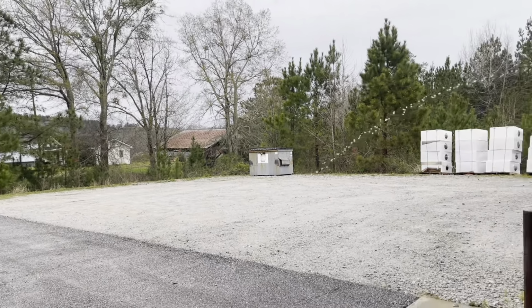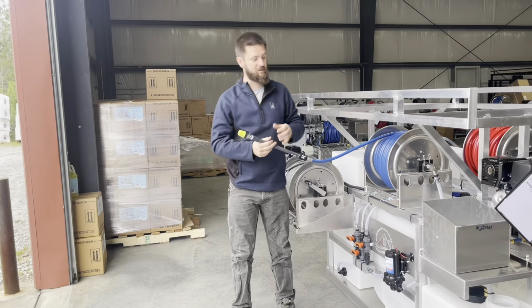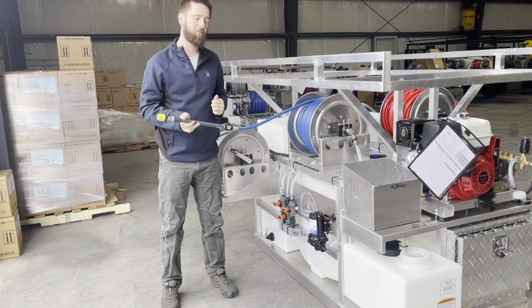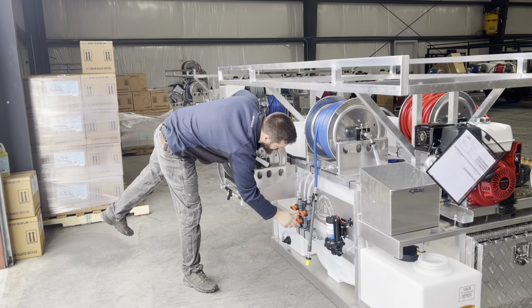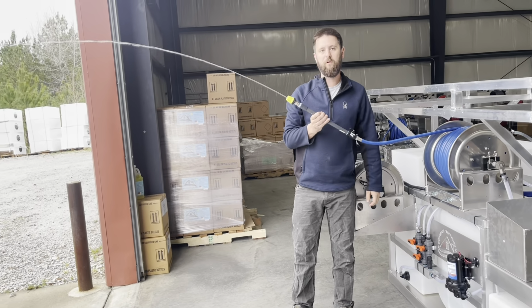Aha! We just lost performance. Massive drop, because once it started trying to run and it sucked that big pocket of air up, it cannot prime. Okay, so how could we begin the troubleshooting process? Well, the easiest thing to do is just start isolating valves. Cut 2 of them off, leave 1 of them on, and see if it'll run.